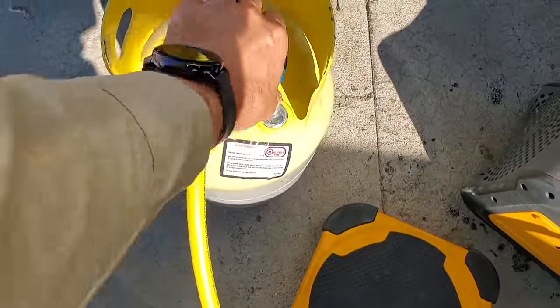For precaution, what I ended up doing was I stopped at 10 pounds because that's when I started feeding vapor through from that cylinder. I only fed liquid out of that one. My hope is that if there are any non-condensables, they stay in the vapor phase and didn't come through in the liquid phase. So we still need 1 pound, 8 ounces to finish the factory charge, but then I'm going to add an extra 4 ounces to compensate for the bigger dryer. So 1 pound, 12 ounces is what we need.